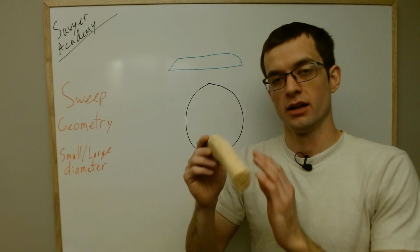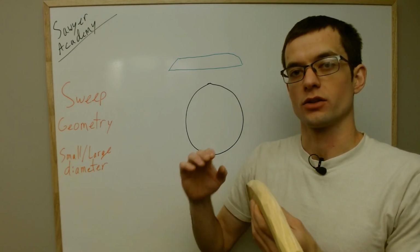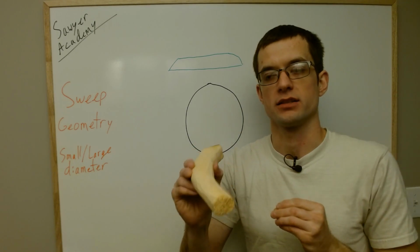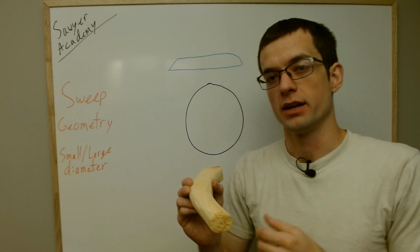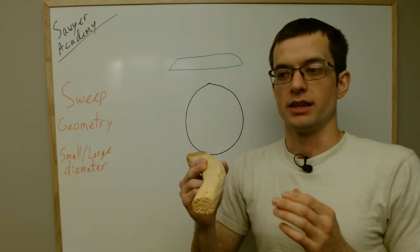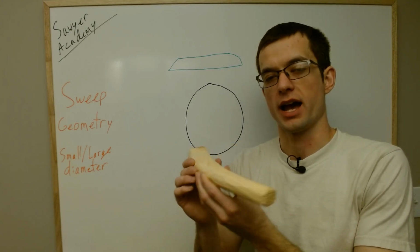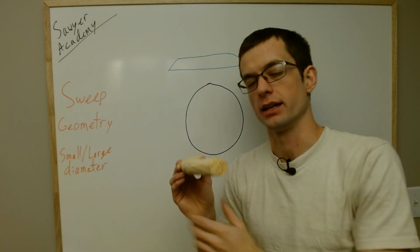So we're talking phase 1 and phase 2. When we get to phase 3, our cants, we've defined our cant and now it's laying on its side. When we get to phase 3 with a carriage, typically I find it better to always be belly out towards our saw line. That way we have 2 points of contact on our carriage, and it's not going to rock as we're trying to position, as it would if we did horns out and belly in.